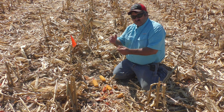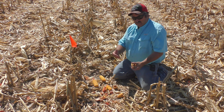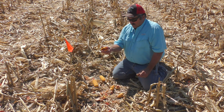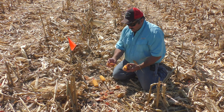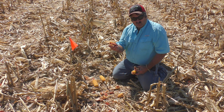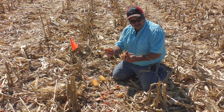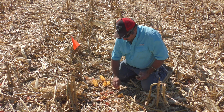As you change varieties, you want to stop that combine, get out behind it and figure out — is it coming through the stripper plate? Some of these are going through the stripper plate and making it to the ground. Then we're going to have to work with the stripper plates. I know we like those stripper plates open for downed corn, so it's a happy medium somewhere in between so it's not going through the stripper plates.